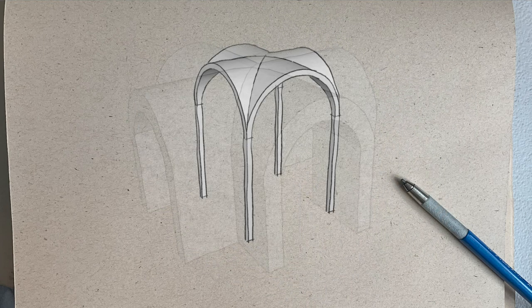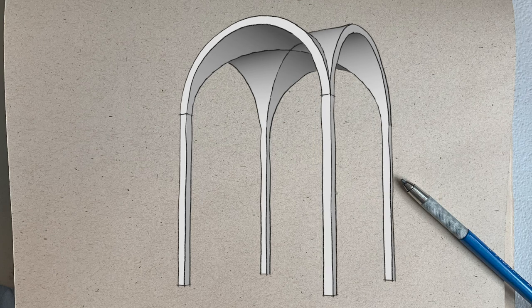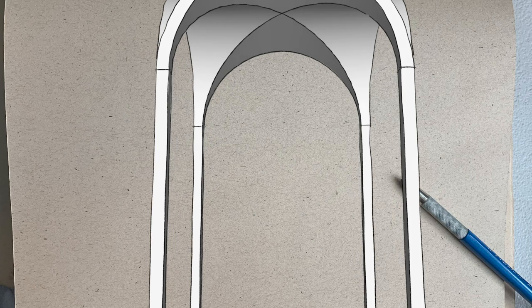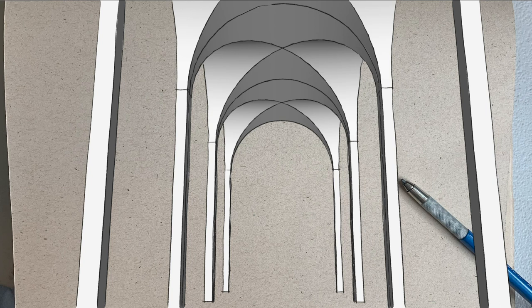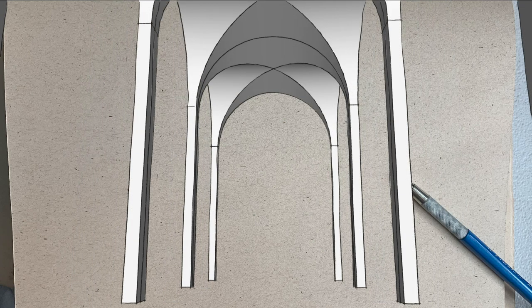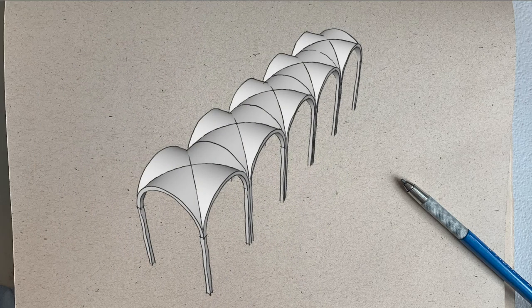Because arches and concrete together are so strong, it allows you to free up the wall space significantly — rather than being bulky, you can free up the space. Because a groin vault is essentially a multitude of arches, you can really free up the space. The Romans took it one step further, realizing they could make a barrel vault much better by creating a sequence of groin vaults. If you have an X where two arches cross in the groin vault, you repeat that over and over to create a tremendous hallway — much taller and much bigger, and far stronger than a barrel vault. This becomes the framework for some of the most grand buildings the Romans built.